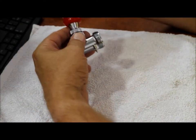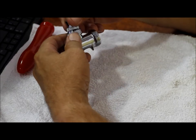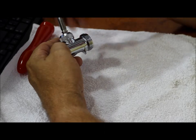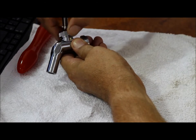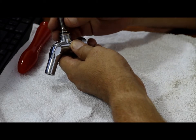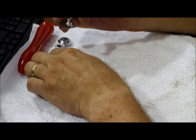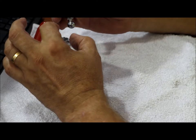Looking at the anatomy of the taps, just like all taps they have a handle on top — we'll just remove that one. Up on the top section we have the handle jacket which threads up along the handle assembly. Then we have the bonnet. You can see the perlick pearl here which sits inside the tap up against the forward seat, which is a large thick o-ring.